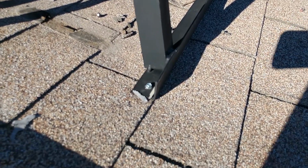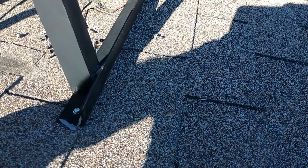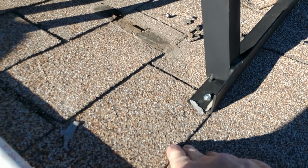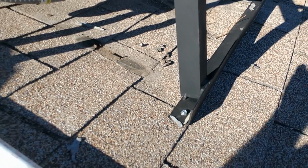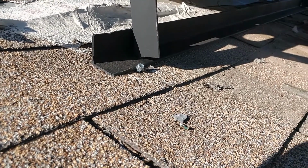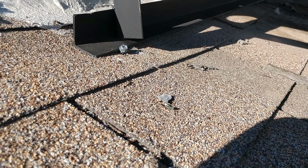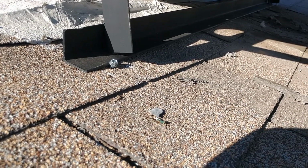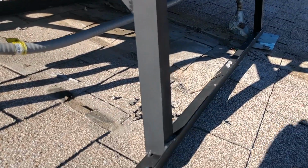Now, that being said, this right here kind of bowed. They missed the beam support, which would be right about here. So they're into plywood. So they're holding this thing up by plywood. It's right here. That's plywood too. They don't even have a hole for that, like they have in this one, to fasten it properly on the backside. Very, very concerned about that.